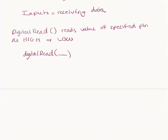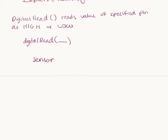If you're having trouble picturing this in practice, imagine this. Your circuit uses a sensor. Let's write this down. Sensor, which has 3 pins connected to a power, a ground, and a pin on the microcontroller respectively. With this setup, you can use the DigitalRead function to access the information from the pin of the microcontroller that is connected to your sensor, the input in your circuit.